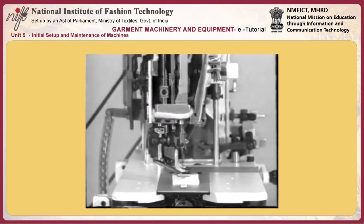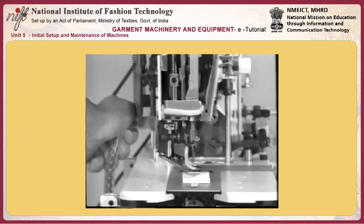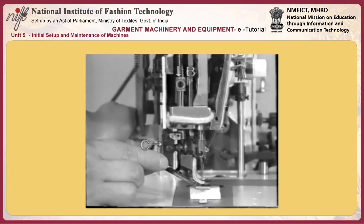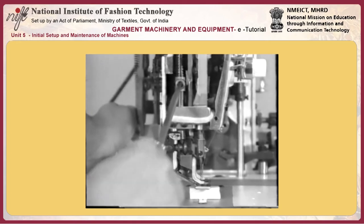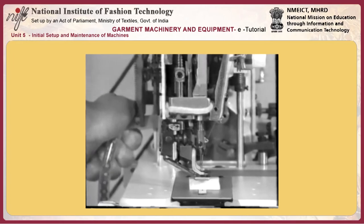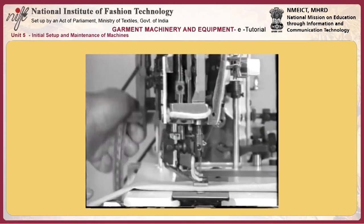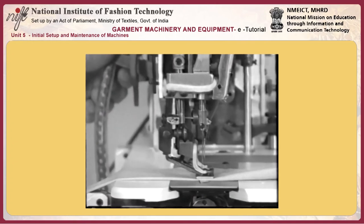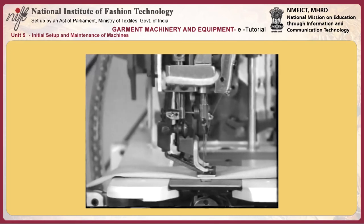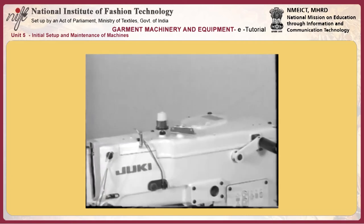Adjusting bobbin thread guide end. The bobbin thread guide works to retain the bobbin thread remaining after thread trimming. Install bobbin thread guide so that portion R of the bobbin thread puller meets the center of the guide. Loosen the set screw of the bobbin thread guide and shift the guide to the right and left to properly position it. If the lateral position of the bobbin thread guide is not correct, the guide comes in contact with the bobbin thread puller, giving rise to an interference with the ascending work clamp check or bobbin thread puller leakage.